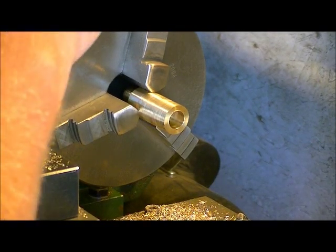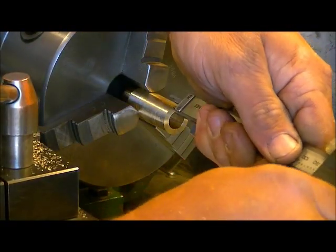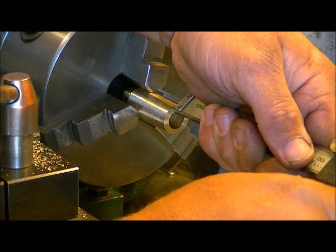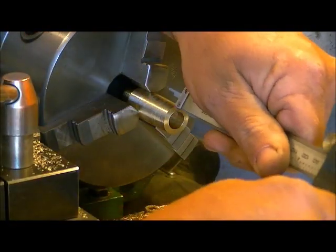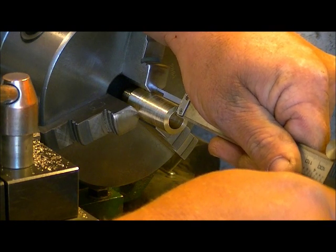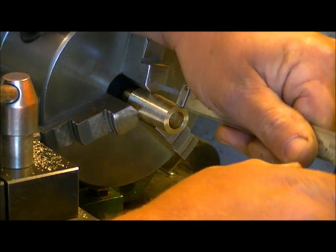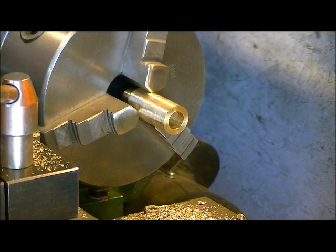So if you want to know exactly what's sticking out, we can check that for you and show you. So we've got an inch plus 56 thousandths. So not much. Just a little over an inch. Well, it's actually, I think it's closer to, let me see. Oh, sorry, I was incorrect. It's actually just under an inch. 859. So we're just under an inch sticking out here. You gotta watch calipers that you always reset them all the time.